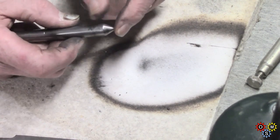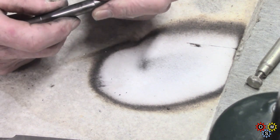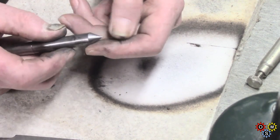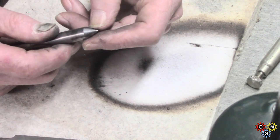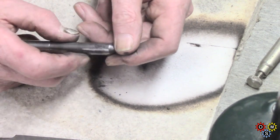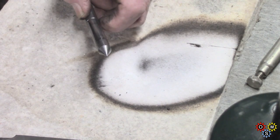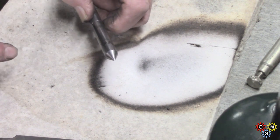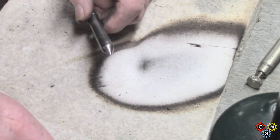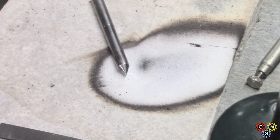That is going to resist wear considerably. If that was in the tailstock acting as a dead centre, we could run that pretty well. I didn't polish it up fully — it takes a while before treatment to get to a really good mirror finish, which is even better. But anyway, that's a very durable tip. I forget the thickness without looking it up — I think you get half a thou or a thou — but it's got a lot of carbon in it just on the skin.